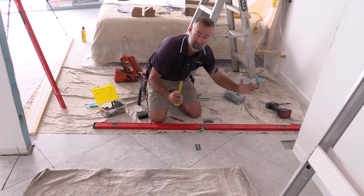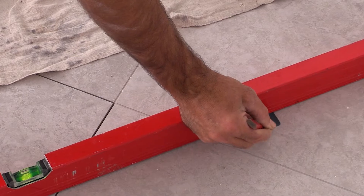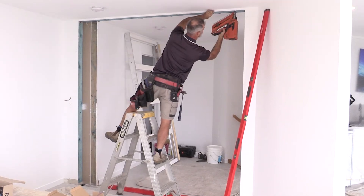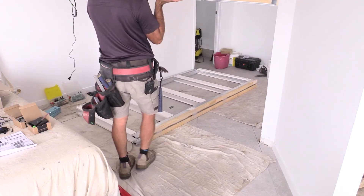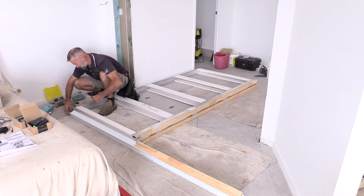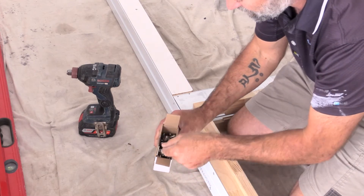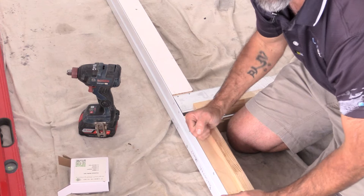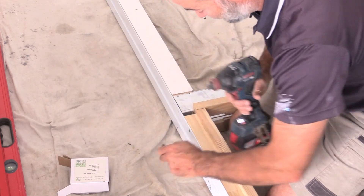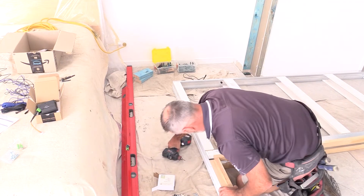So that when I sit this on, it's already sitting perfectly level. Working back, I'm just going to make sure I've got a nice level base and slide my packers through - nice and solid. Now, this is where the electrical all comes out the back of the track. There's a little slot in the back and you've got to make sure that as you assemble this, you slide that wiring down into the slot. In the pack of your cavity kit you'll get your box of rollers, roller hangers, all the bits and pieces. I'm using countersunk screws to go into the top here to secure the frame together - it's all pre-drilled, just line it up and put it into the extrusion to pull everything tight.